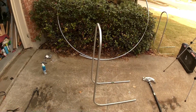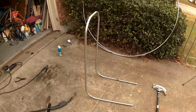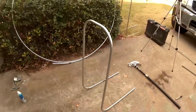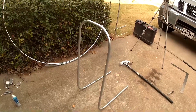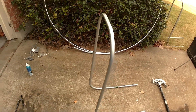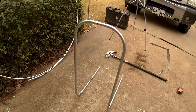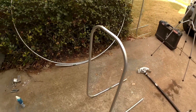It took a little bit of adjusting back and forth, but I'm pretty happy with the result. I didn't get it 15 inches across — I got it 14 inches across — but I think that's still going to be enough to comfortably get the swing arms underneath my arms. My previous paramotor was very narrow and I had to have spacers in there in order to get the arms to where they weren't clamping down across my ribcage.